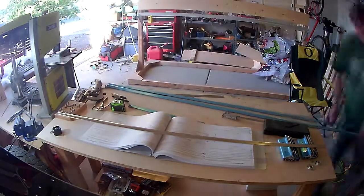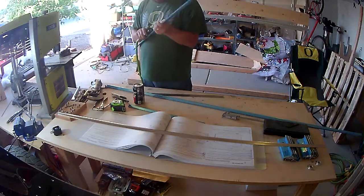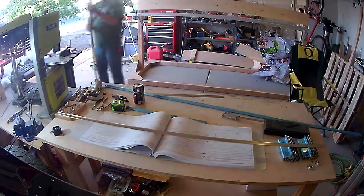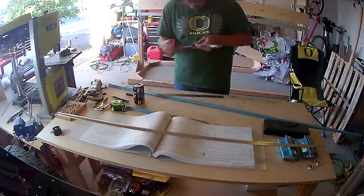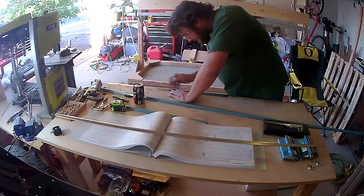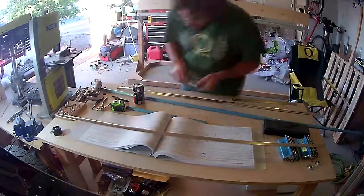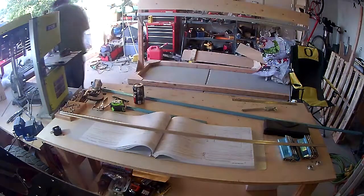My pieces had a slight curve to them, so I had to be mindful of that when drawing out the centerline. Also, as I was drilling through using the skins to final drill the holes for the stiffener, I had to make sure I was holding the stiffener just right so you can see the centerline mark align with the holes you're drilling through. Just be mindful of that as you're working on this — make sure you're drilling the holes correctly and keeping it as straight as possible. Anyway, I'm going to let this video run out here and get back in the garage. Thanks for watching and we'll see you next time.